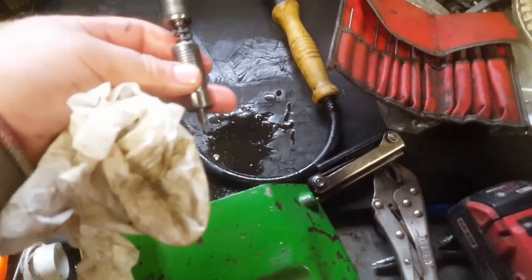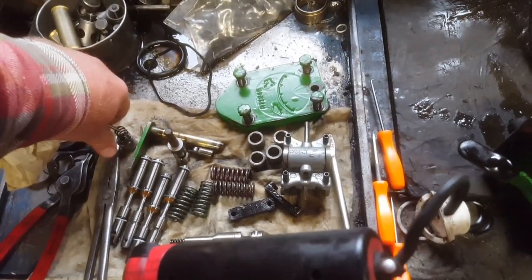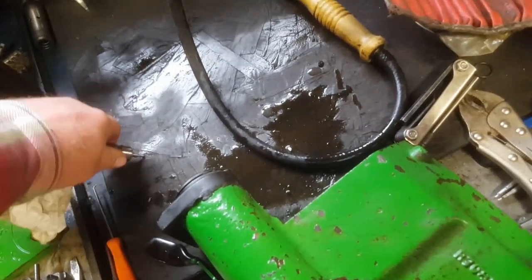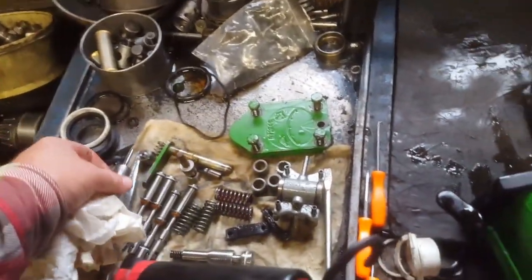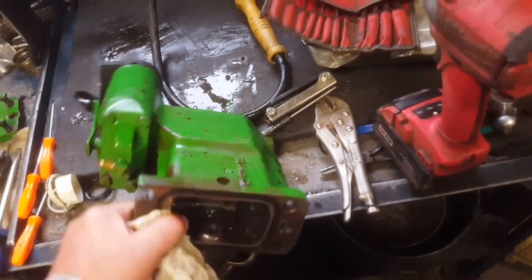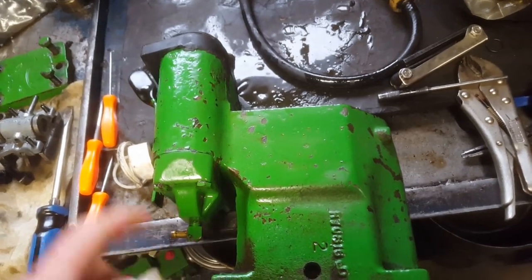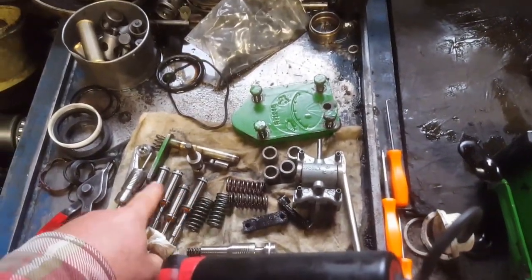So then the detent assembly comes out. The top can fall off and the spring can be loose. You got the spring-loaded side. And so that's that. There ain't a whole lot to it, you know. At this point, you got a pretty hollow piece of casting other than the couplers themselves. So for sure we need four new valves.